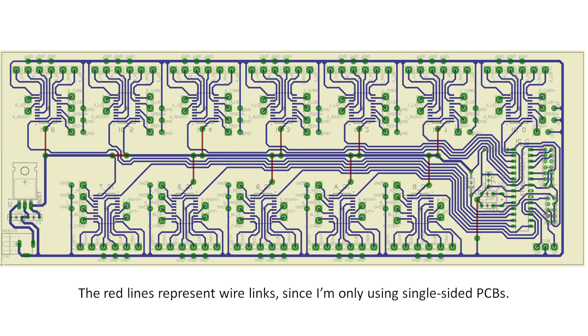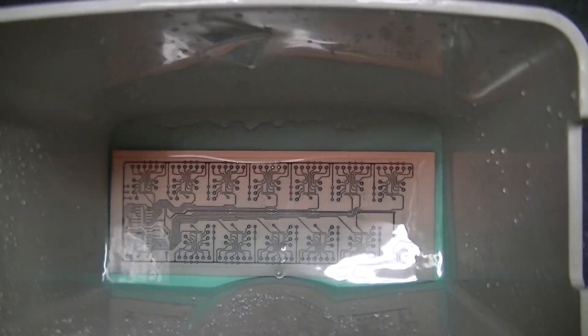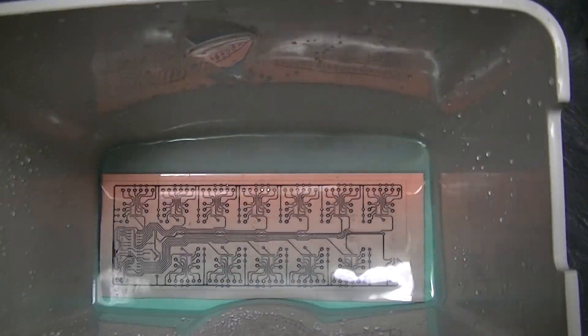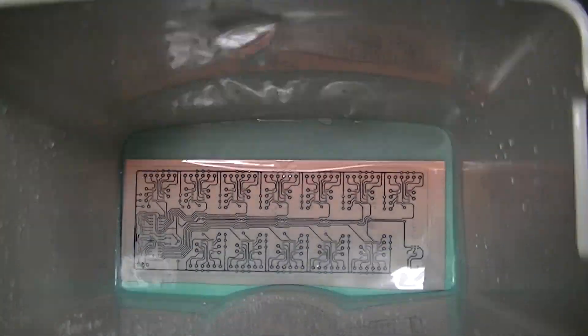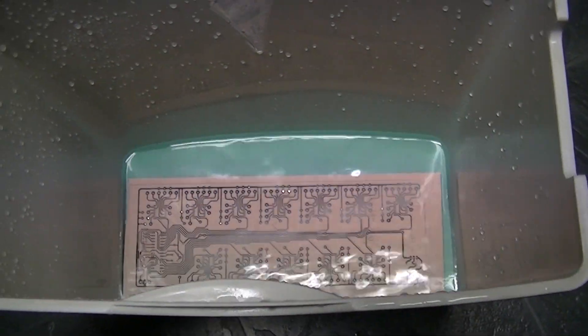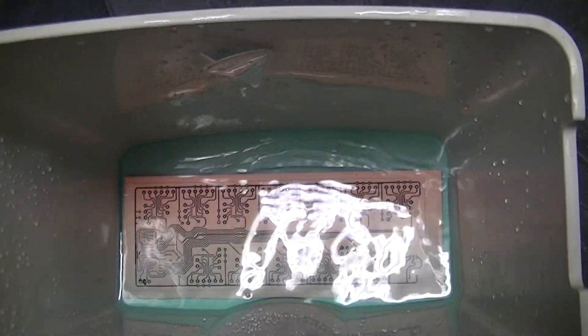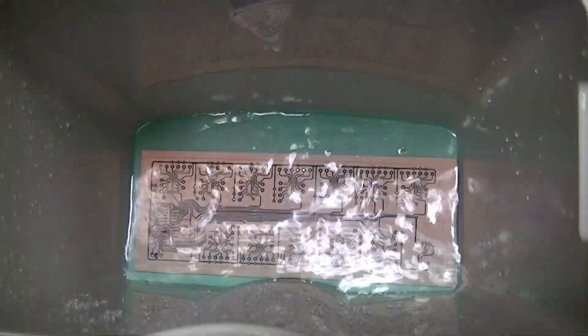That's all present, and that's pretty much all there is to say. Now on to manufacturing the circuit board. What we're looking at here is the printed circuit board being etched. It's ammonium persulfate, which reacts with the exposed copper and creates copper sulfate — which is blue. The water actually started out clear and it's blue now. In about 20 minutes or maybe half an hour, this should be a lovely printed circuit board for me to attach my bits and pieces to. I have to keep agitating it.